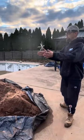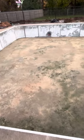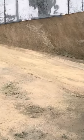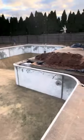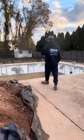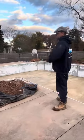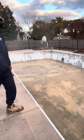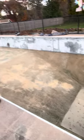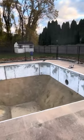I definitely want to point out the pool bottom. If you've been following along on my channel and you saw what this pool looked like when we were taking the liner out, it was just covered in green algae all over the place. There's still remnants of it here and there. What we did was Tom came in and poured liquid chlorine shock all over, took a brush and started brushing it around, working all the algae out of the pool, and then he pressure washed everything. We pressure washed the inside of the track where the liner clips in.